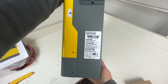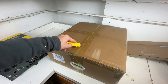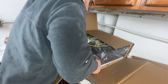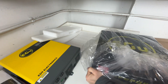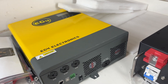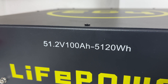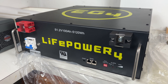As the name suggests, this is a 48V system, so we'll need a 48V battery. I went with the EG4 LifePower4 48V lithium battery, which is the best deal for a smart battery with grade A lithium iron phosphate cells on the market. I paid $1200 total — the most expensive piece of this setup. You can go for cheaper off-brand batteries without communication, but if you want a stable and reliable system that will last 10+ years, this is the way to go. This battery has a capacity of 5.12kWh and can be charged and discharged at 100 amps.